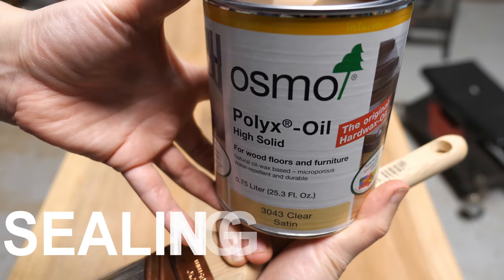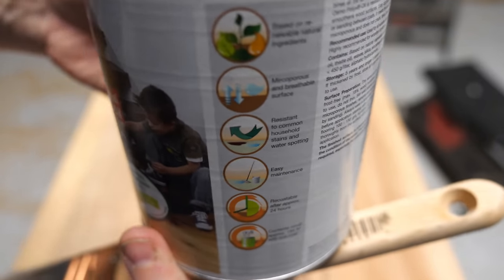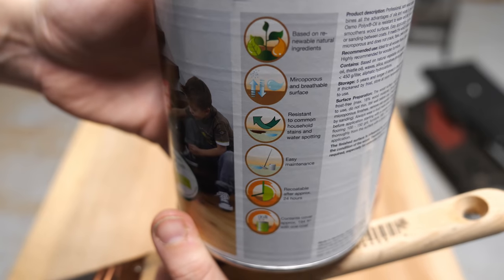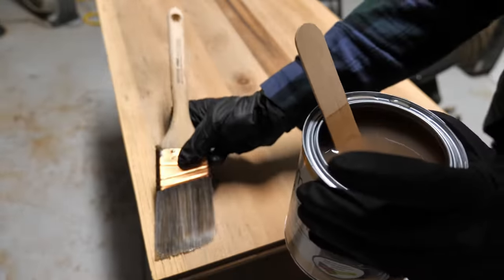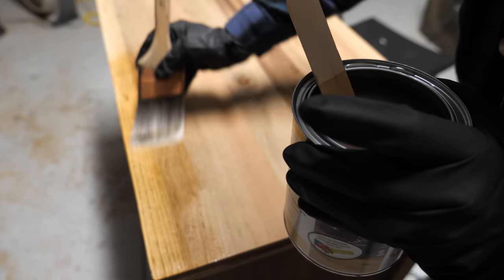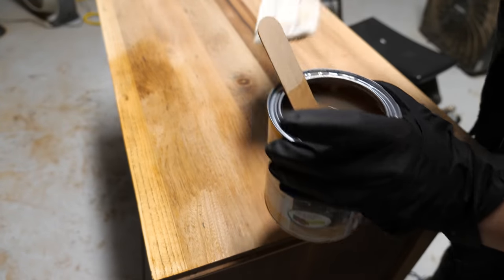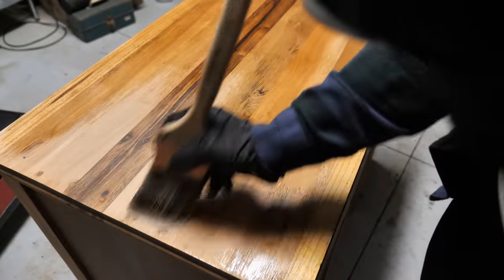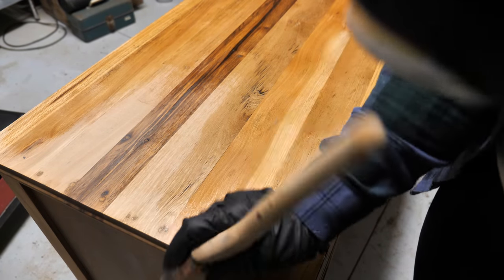I chose to use Osmo hard wax oil in a clear satin finish to seal the piece. I'll put some links below in the description so you can read more about it, but it's an environmentally friendly wood finish. The appealing part to me is that hard wax gives a different feel than your typical polyurethane coating, and the only way I can describe it is it's more earthy. If you have a vision of where this desk is going, this makes more sense than a polyurethane coating.